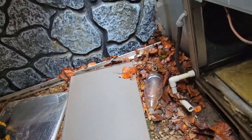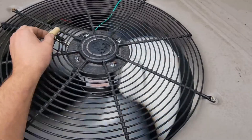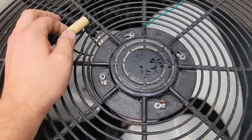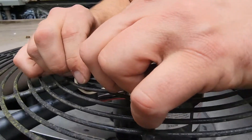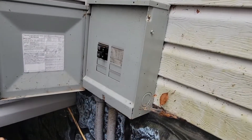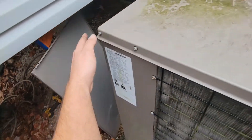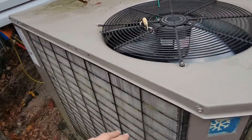Went inside, turned it back on cooling — it's going the wrong direction. Got to shut the breaker off and reverse it because it's not blowing any air up. Now all I've got to do is reverse this — switch that around, plug it back in, turn the breaker back on. Now I need to make sure that I measure the amp draw with this panel on, because without it you're pulling around the coil instead of through it, and this will affect your pressure. Keep this panel on whenever you're making your checks. Now it's throwing the air out of the top.